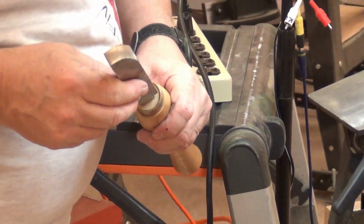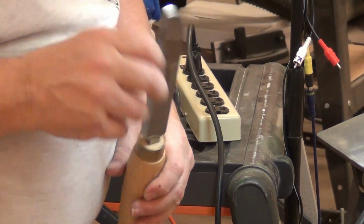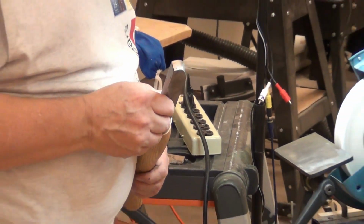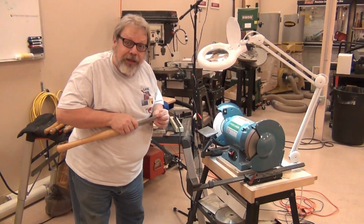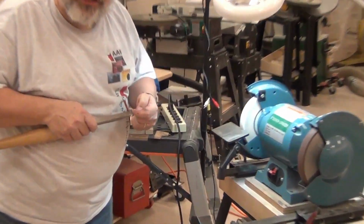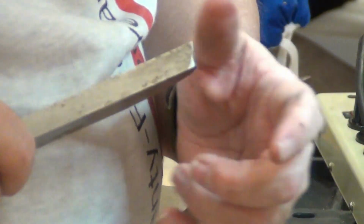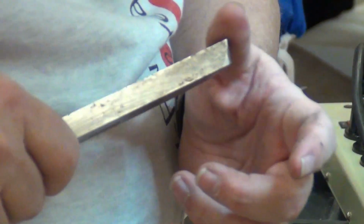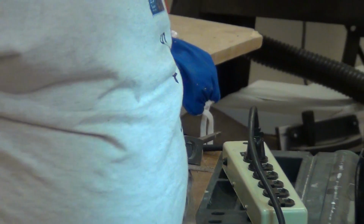See that all right? So that's gone, that hole. This is a thick bevel on a thick scraper, so it's got a lot of hollow grind in it. You can see how much here. If you catch that edge, because it's so thick and with the diameter of the stone, you've got a lot of hollow grind. But that gives you a pretty sharp top. You also have a burr here. A burr will cut, again, for about 10 seconds.